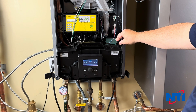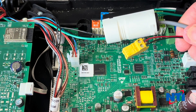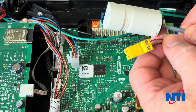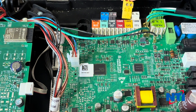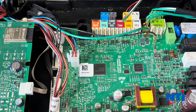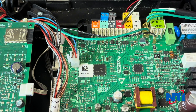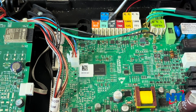Back on the master boiler, we're now going to power it off and connect the system sensor. Your system sensor is mandatory, as mentioned — it is included in the cascade kit and is fitted to your supply pipe. Connect it to the system outlet on the main board. Also consider your tank sensor, which can be used for either a 10k sensor or an aquastat. In a cascade, the only time you would connect a tank sensor to the follower boiler would be if you're serving an upstream tank — otherwise everything connects to the master.